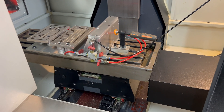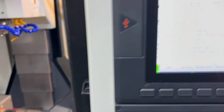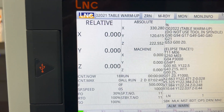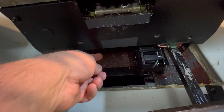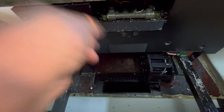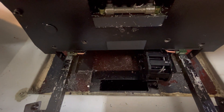Now I do have an X-axis ball screw problem — I've had it since new, it's a bit noisy. They're all homed and you can see my machine is all zero, zero, zero. When I was setting it all up I set my relative to zero as well. I had to take the covers off and find where the Y ball screw was, and have my finger in there real gently and just manually jog it as close as I could get to the bearing bracket — and come off it because you don't want to crash it. That's when I did my Y reset and I've got my full travels back again.